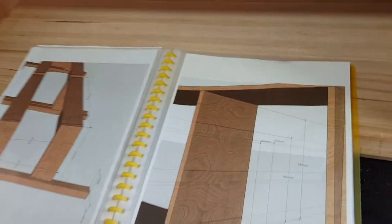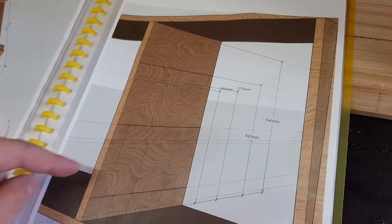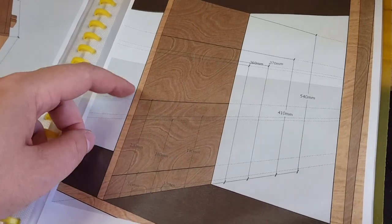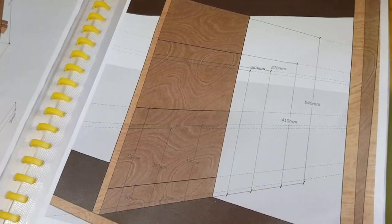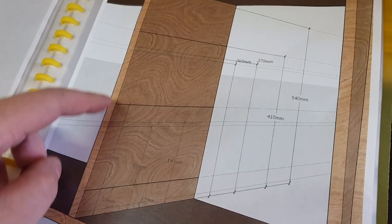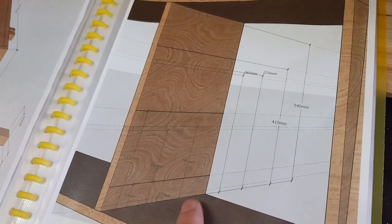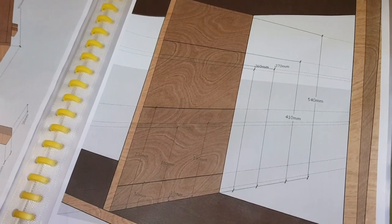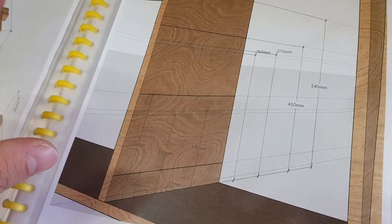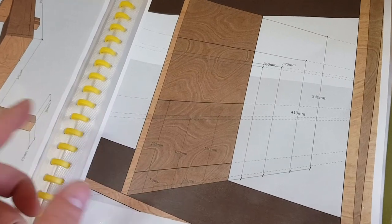Whenever I'm doing drawer slides, and something I haven't shared, I always like to map out exactly where they need to go. So I'll always go into Google SketchUp and draw lines where they need to go, and then create risers or shims to the exact heights so that I always know where the drawer slides are going to go, and it just takes out all of the guesswork or confusion or messing up a measurement, because you're trying to work it out as you go.